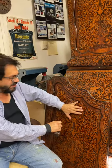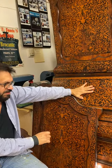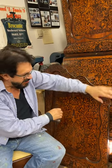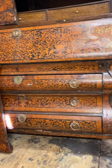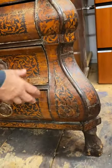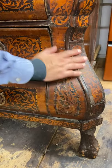The same thing with the doors — the substrate panels were made, the marquetry was done, and it was pressed on. But obviously the more difficult objectives are around the surmount of this piece, the drawer fronts, the base, and the sides going down. Down here we can see some loss. Where you have some very crazy vectors of movement in the substrate of the wood, that's where the glue tends to fail and relieve itself where the marquetry is adhered.